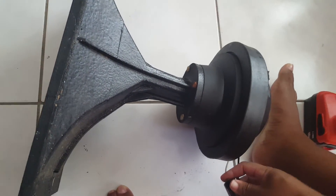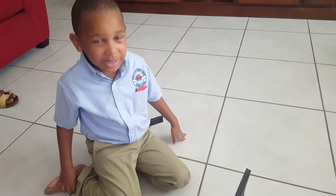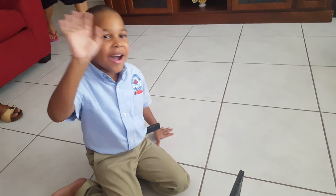Michael, want to help daddy? Come hold daddy's phone right there in front of the horn — two hands! When you touch the leads you should hear a click, and that tells you you have a good functioning new diaphragm. Thanks for watching — special thanks to my son — and we'll make more videos. See you next time guys!